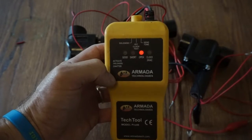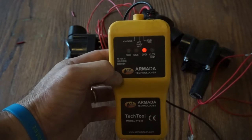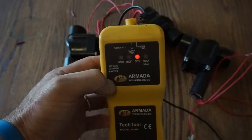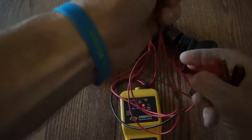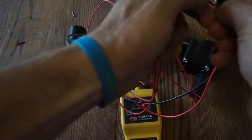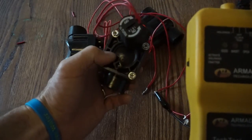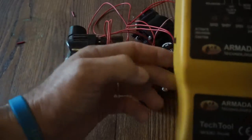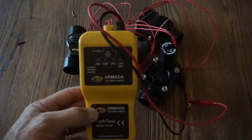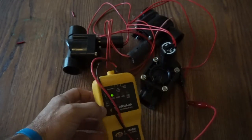The other thing I use it for on a consistent basis — one of my first steps in trying to find lost valves — is I will use this multifunctional tool. I'll hook this up at the controller and then just start walking the property. It's got a chatter feature on it, which I'm going to show you. Hook it up and it will help you identify lost valves. It doesn't sound very loud, but in the field, if you have a valve you can't find, you can use the Armada Pro 48 to hook it up to the wire path and then just start walking the property and listening for the chatter.